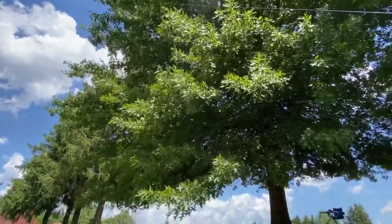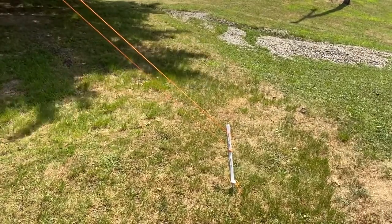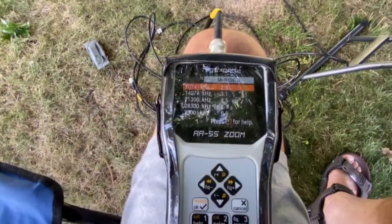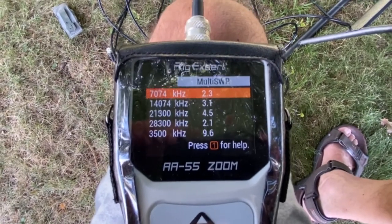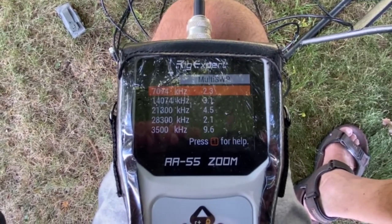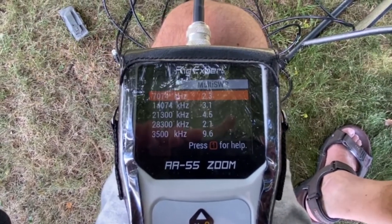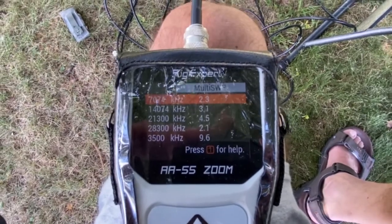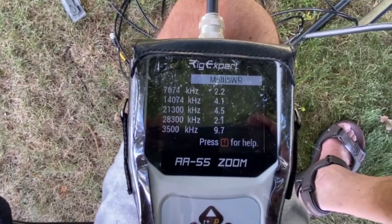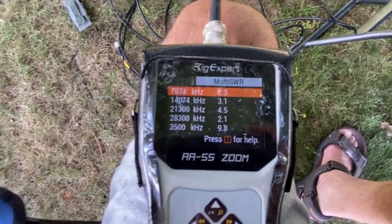Those trees are moving — that's got to be a problem. We'll do the SWR test now and check out how this antenna does across 40, 20, 15, and 10. K2PMD back here doing the SWR test. Not as good as the KM4ACK. Definitely not working on 15, and 3 to 1 on 20. I'm going to run it like that — I don't have time to adjust the lengths of this wire. The only ones that are really usable are 10 and 7, but none of them are under 2.1.